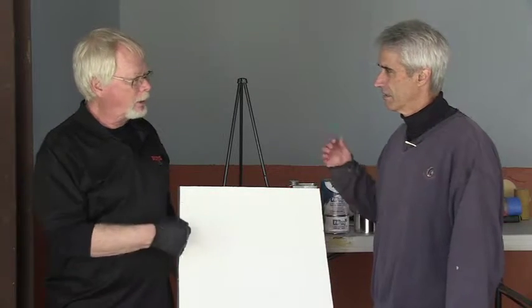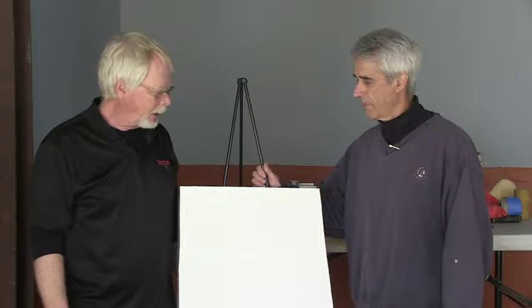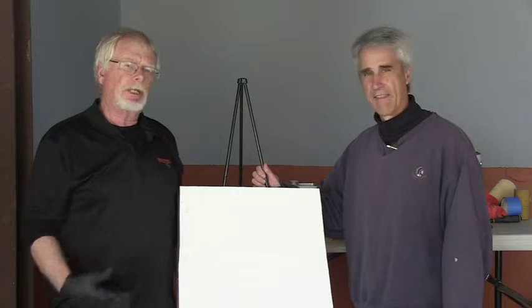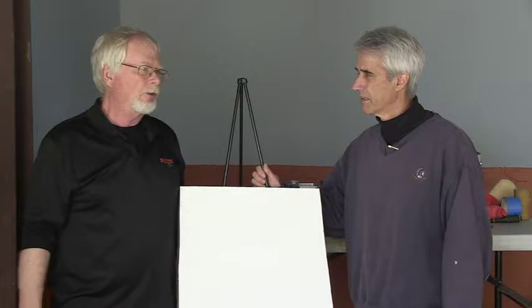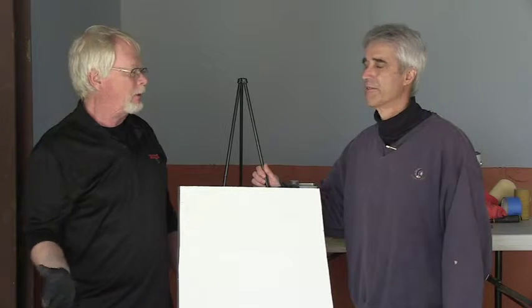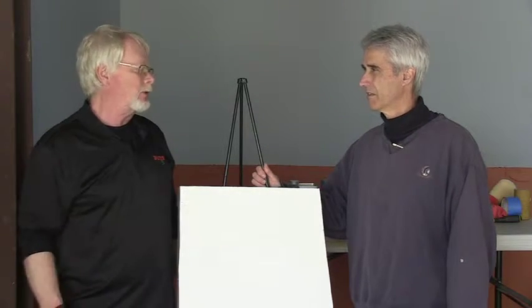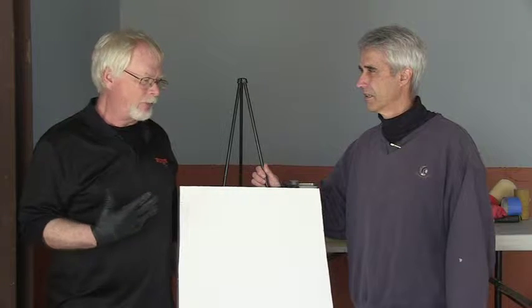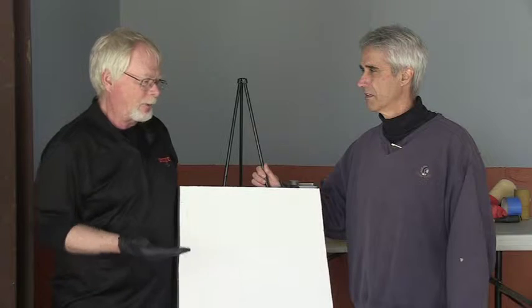You roll and tip the product on, just like we're going to show you with the finished product, same technique. But after this sets up the next day, you come back with a board sander and sand it back hard. You might remove the paint 50, 60, 70% of it, completely taking it off the high points, leaving it in the shallows, the valleys, the cracks, and the crevices. With real imperfect surfaces, it may take more than one application to get the small lower points to come up to meet the high points.